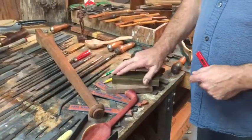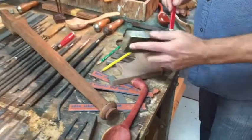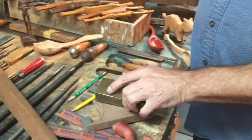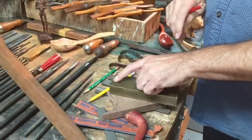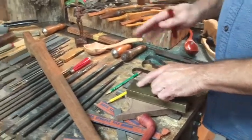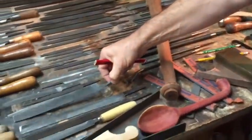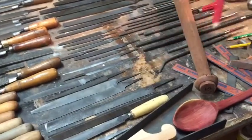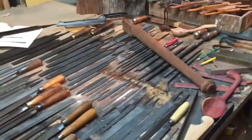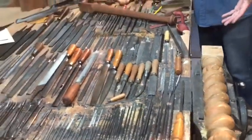Files work very well also on metal, as you can see here — this is a piece of solid brass, and you can see how shiny it is where I filed that edge. Sometimes I'll put a screw in a piece of furniture and it'll be just a little bit proud, and you can take a nice flat metal file and take that down and make it perfectly smooth. So another use for them — here I have an assortment of different types of files and we'll go through some of their uses.